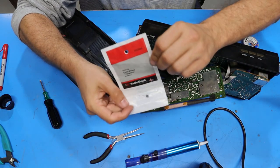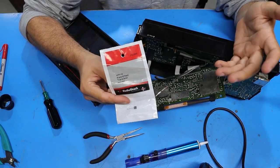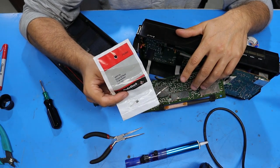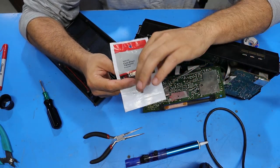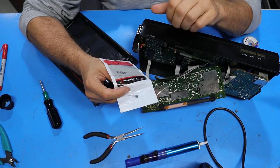So here's the new transistor that I bought — this is a RadioShack MPF-102 transistor. It's currently September of 2020 and it's difficult if not impossible to find RadioShacks anymore. I'll admit that I bought this part about five years ago when my local RadioShack was still open. Now because RadioShack is no longer open it's going to be a little difficult to get a hold of an MPF-102. I did a little digging and found that Jameco Electronics still has some on hand — you may be able to order from them. I haven't researched whether there's a suitable cross-reference to an available part, but if you do a little googling you may be able to figure that out. If you find a cross-reference please leave it in the comments. Also, these parts are static sensitive and I don't have a wrist strap handy, so I'm going to have to be real careful with this part.